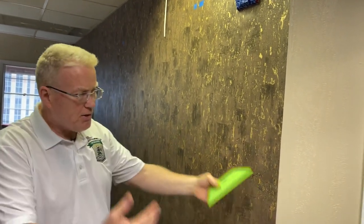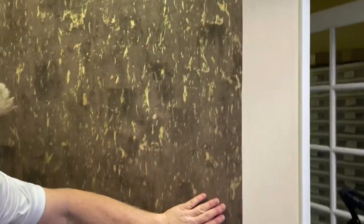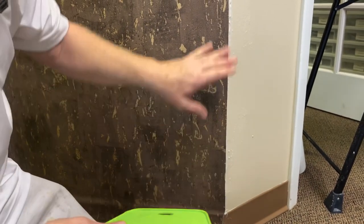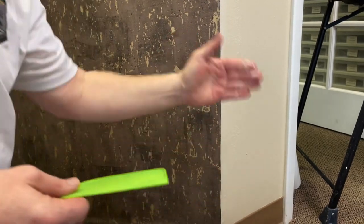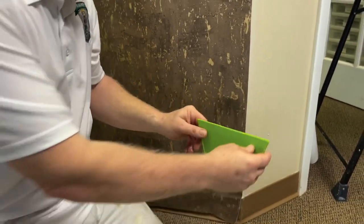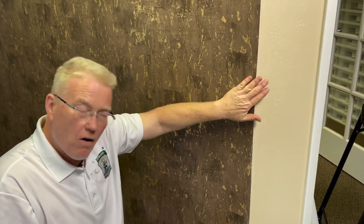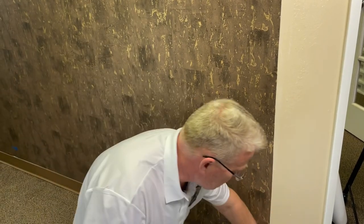Please show them from here. Look at that cut, folks. Can you go up and down so they don't think we're deceiving them? Look at how pretty it is. Now, if you have imperfections in the straightness of your obtuse angle, your wallpaper will simply follow those imperfections. If you didn't do very well and you're over your corner, extend your blade and use it like this and go back and forth. The only thing you're going to wind up slicing is the paint. Don't be afraid — you can do it. Okay, that's how you cut wallpaper on an outside obtuse angle where the wallpaper dies into the corner. Not an easy task. We'll clean this up and show you the final result on the next frame.